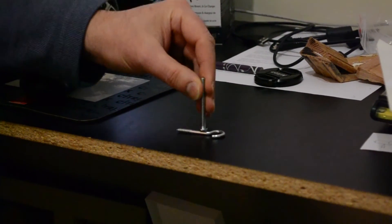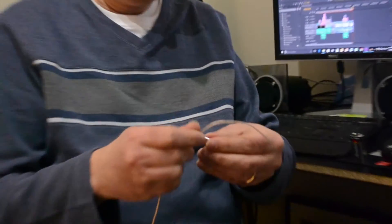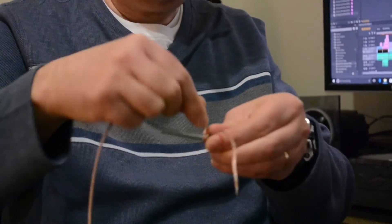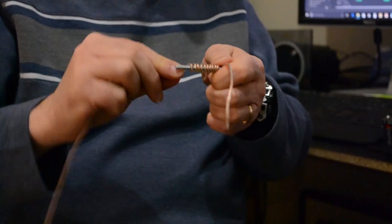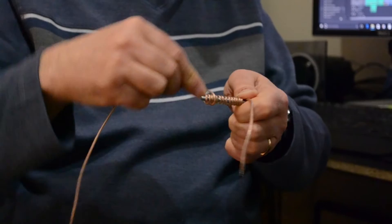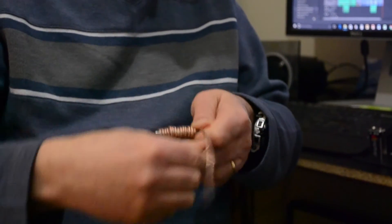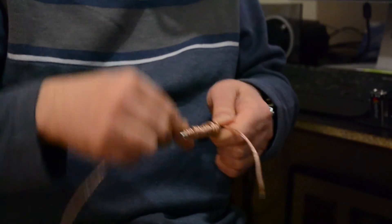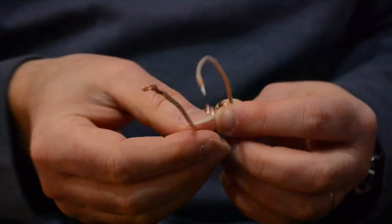So if we have something magnetic, we can move something metal — but this bolt isn't magnetic yet. What we're going to do is turn it into a magnet. This is an old school science experiment. We're going to take a chunk of wire and wrap it around this little bolt, keeping winding in the same direction — that's important when making an electromagnet. We'll just keep on winding over and over until we've got our wires back at both ends.